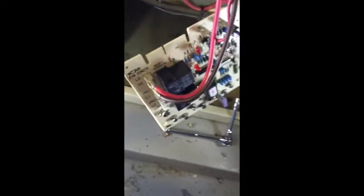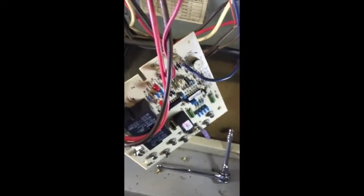Okay, so I moved a couple of the wires over. I started with off the old board, the Sec 1, the Sec 2, the low, and the high. The Sec 1 there, Sec 2 there, low, and the high one beneath that. These wires have been on this board since 1985, 87, so it does require some force to pull these connectors off. You don't have to be gentle, but the contacts, believe it or not, they're still in pretty good shape on that old board.